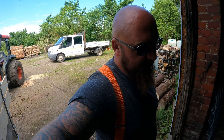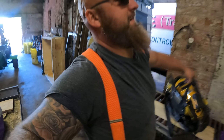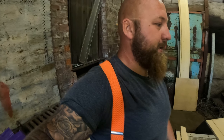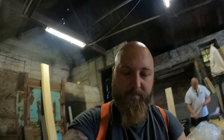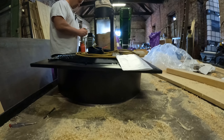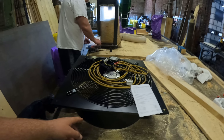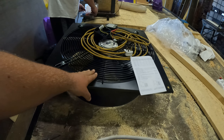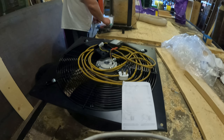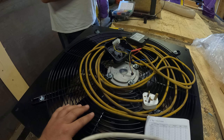We're going to work on the kiln a little bit today. We've got a fan that needs to be installed on the container. What we've got is a 24-inch fan, but it's blowing the wrong way. It needs to suck in here and come out there. So this actually needs to get mounted on the inside, which ain't no big deal. What we're doing is extending these wires and mounting the motor externally, outside the kiln.